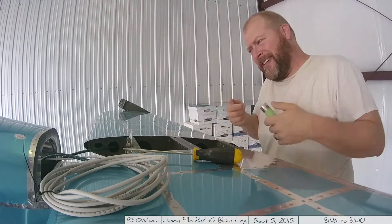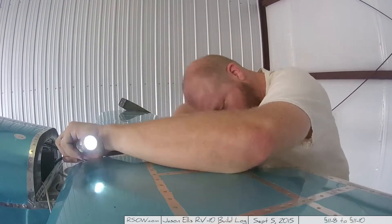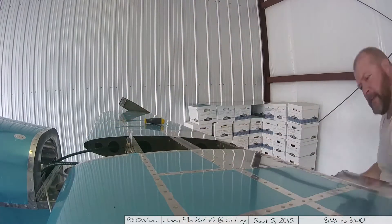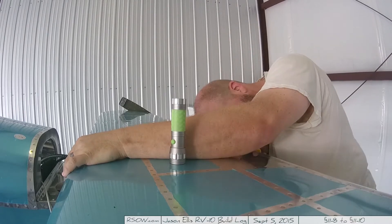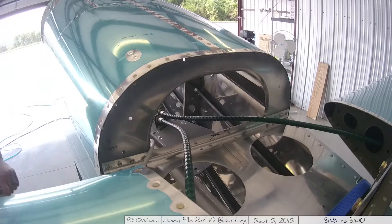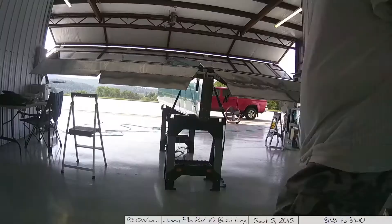In the foreground you can see a big spool of wire. Something I didn't show because I forgot to record it is wiring up the trim servo to the longer wire — you need to run that all the way to the front of the plane. It's a six-strand shielded wire, suggested by Lynn. Lots of just feeding that wire and trim cable in, and then once you have them all in there correctly you can mount and screw down the mounts so it's in there permanently.